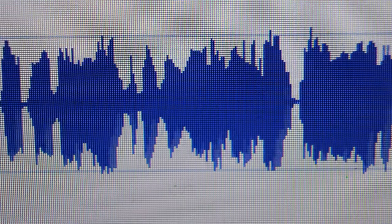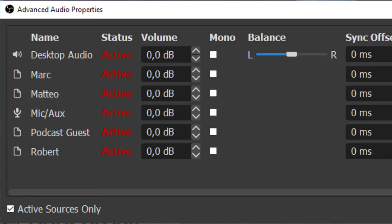Don't get me wrong, this is what you want for an audio interface and for a DAW. Now on a computer for streaming it's slightly different — you can use alternative software to reroute the audio. The computer can take those channels and merge or mix them, or in things like OBS you can tick a box to say that's a mono track and it will come out of both the left and the right. But predominantly audio interfaces were designed to take the raw sound of a device at the highest recording quality possible and were never really designed for live streaming. So if you already have an audio interface, how can you fix this?